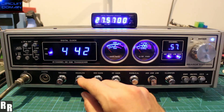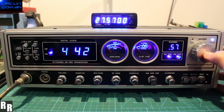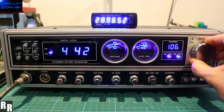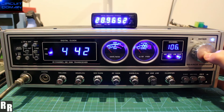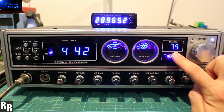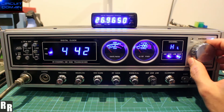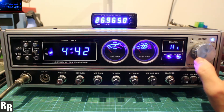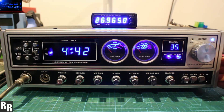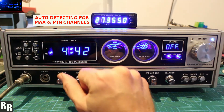For setting up the kit, make sure squelch is definitely on, then five button press. We're going to choose PLL — MC145106. Encode: in this radio, no matter what PLL is inserted, it's always going to be 79, because of the mathematics of the antenna frequency and the filter stages. Squelch: definitely high. Home encode: we'll leave it at 35, which can be changed later for whatever the owner wants. Lock detect: squelch up high.